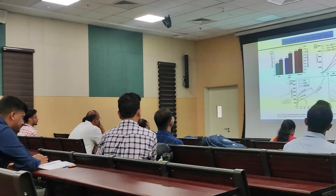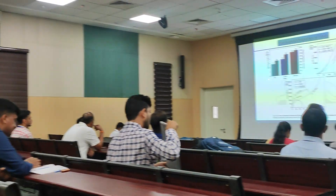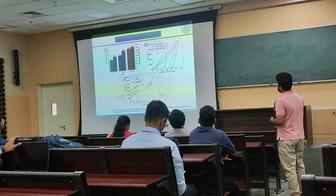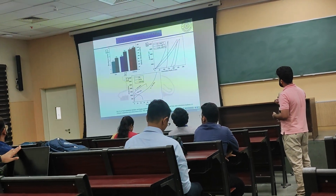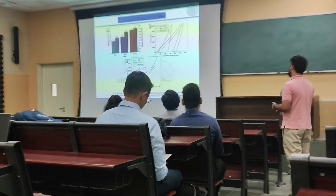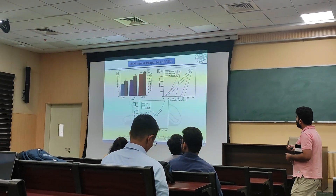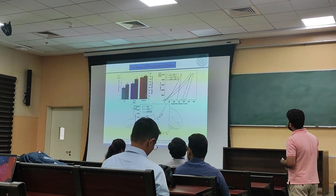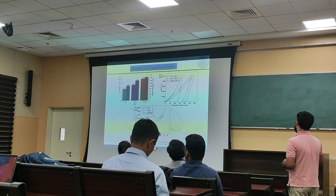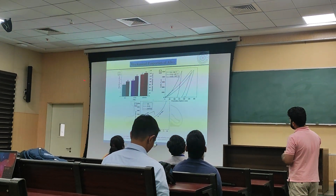Further, we will look at the mechanical properties impacted by the decreasing grain size. At 2.9 micron grain size, hardness was found to be 2.7 GPa. As the grain size starts to reduce, mechanical properties start to increase, which can also be related to the Hall-Petch relation. Accordingly, in the nanoindentation test we found the elastic modulus, and the curve shows penetration depth — the higher the hardness of the material, the lower the penetration depth — which correlates with the hardness as well.